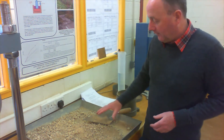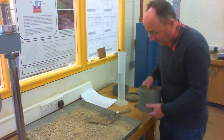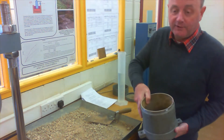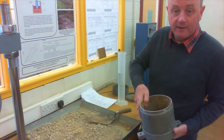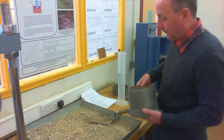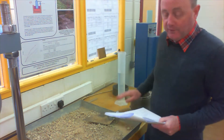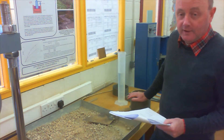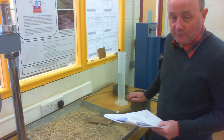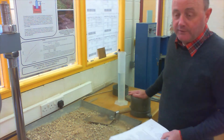What are we going to do with this material? We're going to put it in a CBR mould. It's very heavy, with a big heavy base on it — this is a standard CBR mould. I've already weighed it, and you need the weight of the mould so you can calculate the density of the compacted soil. From my notes, the weight of the mould in the empty condition — this is M1 in your handout — is 8,940 grams.